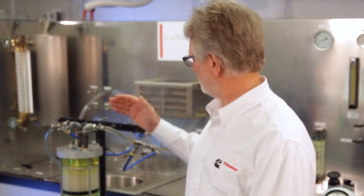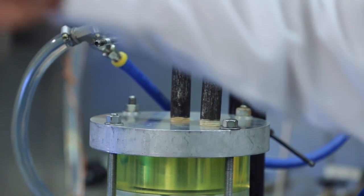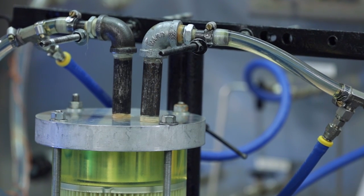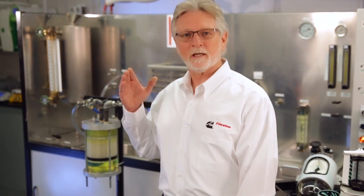Right now, there is clean, clear fuel flowing through the filter. This hose is the inlet to the filter and the other hose is the outlet of the filter. Now we begin adding water to the fuel. We can observe the water and fuel mixture in the inlet hose. The fuel alone was very clear, but the mixture of water and fuel has a cloudy appearance. We can also observe the outlet fluid which is clear as a result of the three-stage unit taking water out of the fuel.